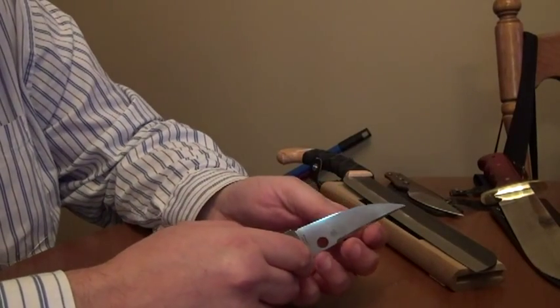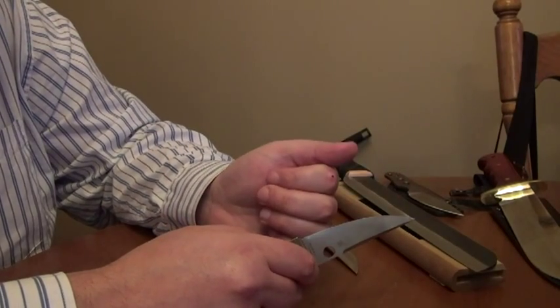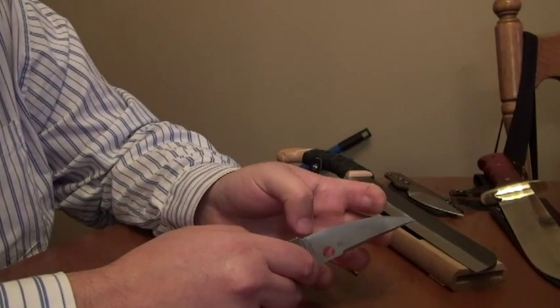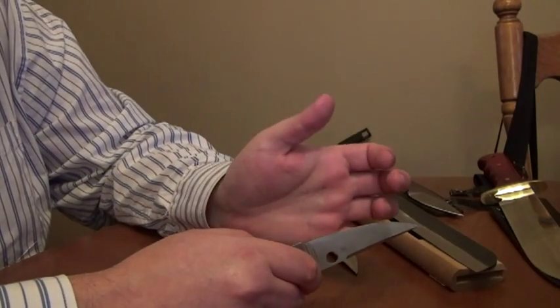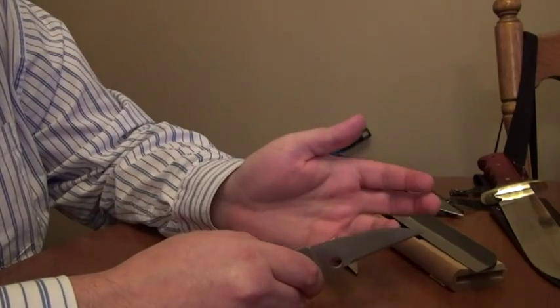In regards to edge durability, as I noted, after I de-stressed the edge and sharpened it, it formed a relatively large burr on the 1000 grit stone last time, so I had to knock that off and re-sharpen it again. No issues in the kitchen, usually cut on a wooden or cutting board, sometimes I use plastic, held up perfectly fine.